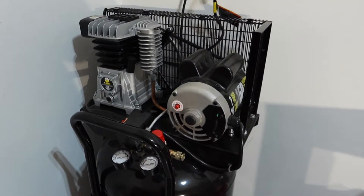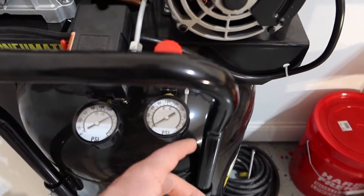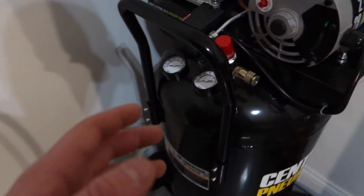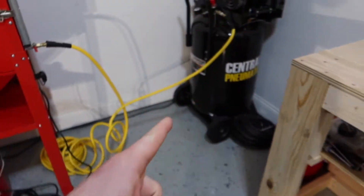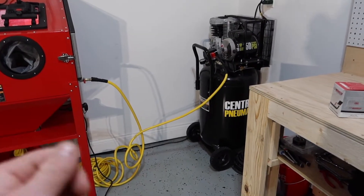I'm using the valve on the actual air compressor. I bought another pressure gauge to try and hook up to the cabinet but it was just too much, so for now I'm just going to use this one. Within my air system, air comes out of the compressor, goes through a tube, then through an on-off valve and also a one-way valve. That one-way valve allows air to go from the compressor to the cabinet but doesn't allow media or water to flow back into the compressor — important for preventing damage.